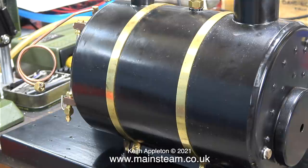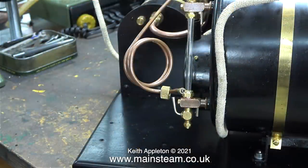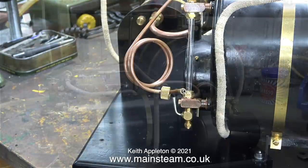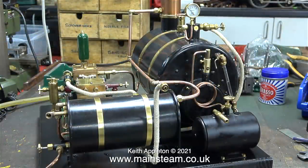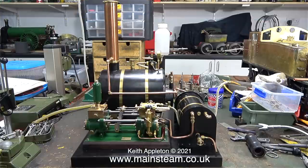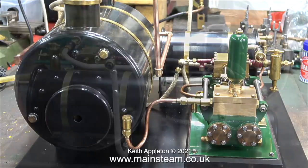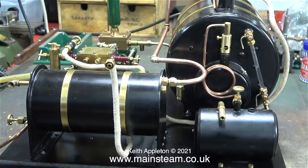The next part to be fitted to the baseboard is the boiler, held in place by four 2BA bolts, and here it is looking resplendent with its new three-cock water gauge. The burner pipe is bent a little bit out of shape because I did steam the boiler to experiment with different sizes of jets in an attempt to stop it triggering my carbon monoxide alarm. The exhaust from the chimney smells quite fresh and doesn't normally have the horrible smell generated by incomplete combustion of the gas. I will make the new owner aware of this. The best place to steam this plant is going to be outside anyway.